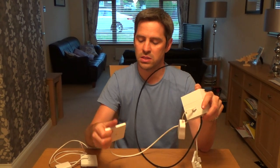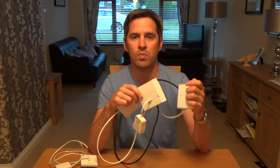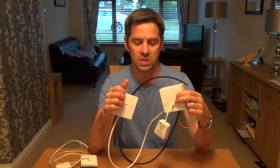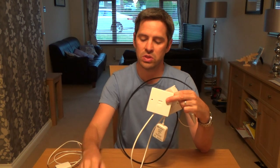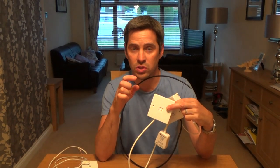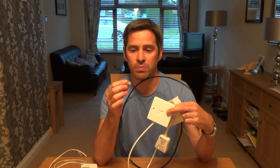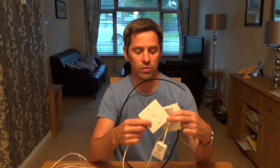But let's say it's a bit of an oversight and you've already got two extensions in your house and you just want a third one — pretend this one is going to the back room, the master socket's in the hallway, this one's going to the front room, and you want one going to the office upstairs. If it's just one more, what you can do is use these little jelly crimps to extend the wire. You would connect two extension wires onto one short bit of jumper wire and connect that jumper wire up to the front plate — basically turning two wires into one wire.